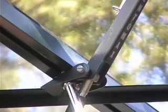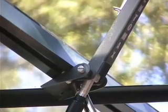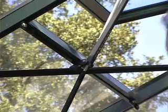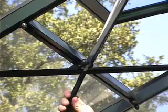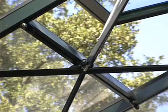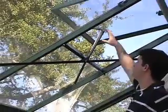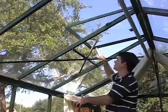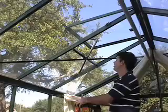The shock here has a screw on it — this is where you adjust how much height you want to open it when it's at maximum. There's also where you put this pin in here. But here down in Texas where it's hot, we just barely screw it in because we're going to get plenty of travel when it's warm outside. When it gets down to 70 or below, this roof window should come all the way shut. So if you have this screwed in too much, you can screw it back out and when it's 70 or below, that'll adjust it down and shut it all the way. And that's going to be the install of your automatic roof window opener.